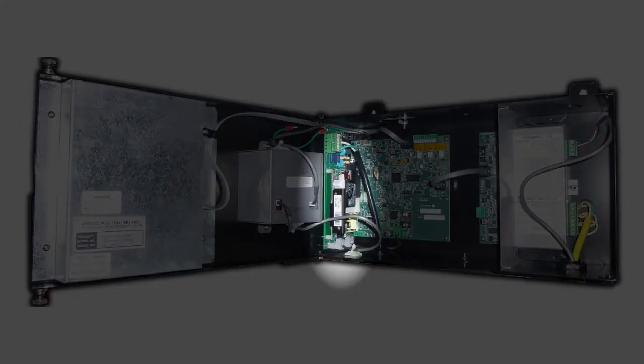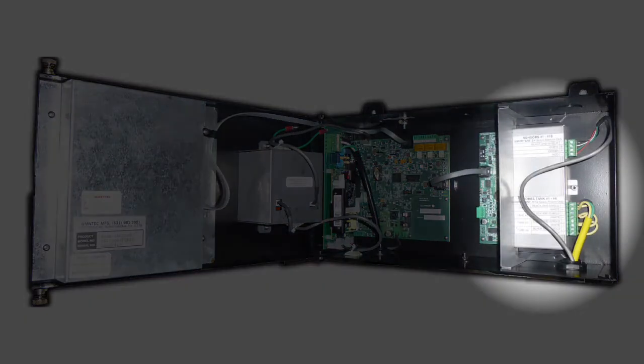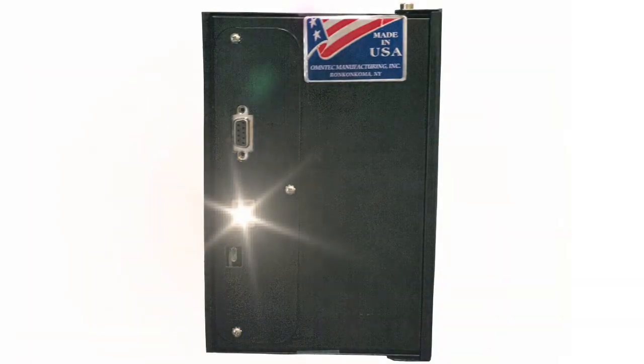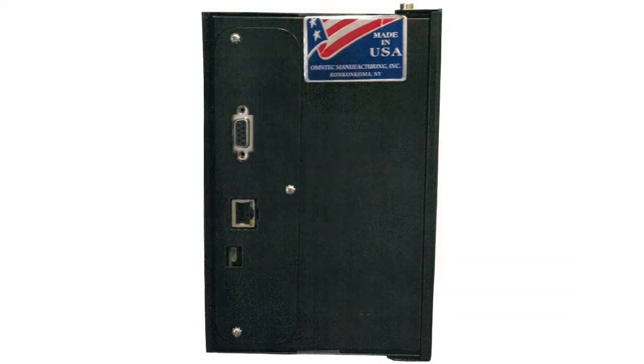On the left side of the controller is mounted the unit's power supply. On the back left side is mounted the main control unit or MCU board. A red RS-485 communication board, optional on the Proteus K, can be mounted on the MCU. On the back right side is mounted one of two different probe sensor interface boards, which are explained later. The interface board will have a metal barrier to separate the intrinsic and non-intrinsic sides. The TCP/IP RJ45 and serial RS-232 DB9 communication ports are located on the left side of the controller.